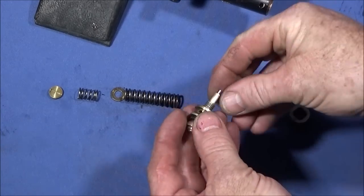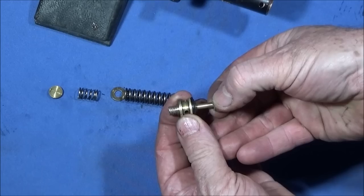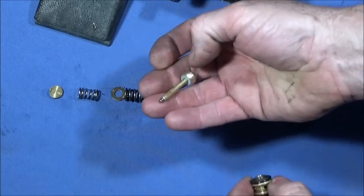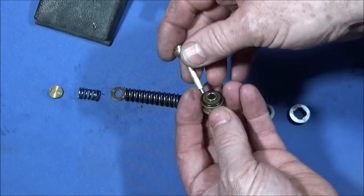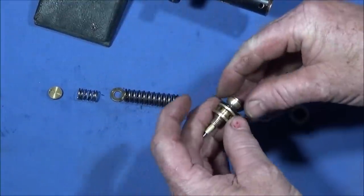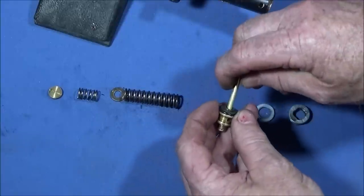So if you do take this valve assembly out, just check the spindle there is a nice close fit at the back there, that the valve opens and closes smoothly, and obviously the seal on the front here, you'll know whether that's leaking or not and whether you need to make this part again. They're relatively easy to make. Like I say, you could actually make this housing and the valve assembly all together on the lathe in quite a short period of time. And I might actually make this housing again. I'm going to measure it up anyway now it's out and keep a log of that.